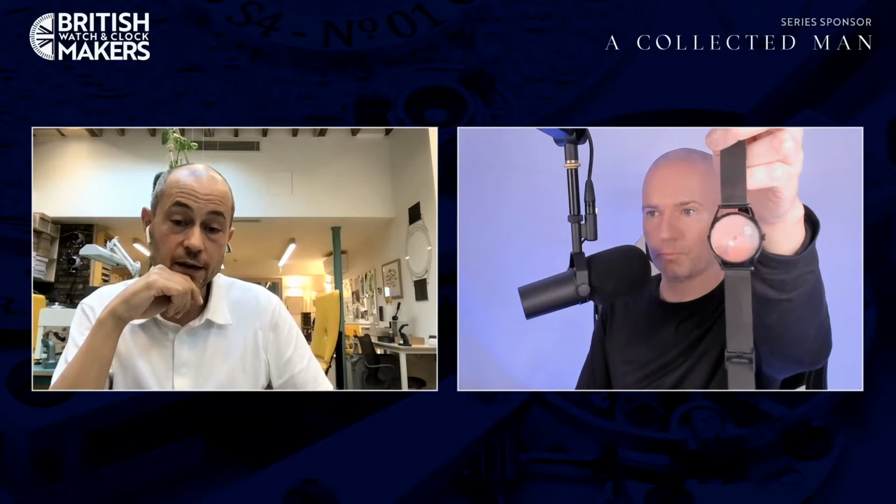This is a really nice thing. So this was designed by Paul, who is the head of printing. Paul is a fine art printmaker as well as working for me. He was really captivated by the Mars rover and the fact that Mars has 2 moons that circle it. So it is the red planet, Mars, and it's got these 2 moons that are glow in the dark. They have a luminous compound in the printing ink, which was something we had never done before. It's quite difficult with pad printing to build up a sufficient amount of the luminous material to get that luminizing effect. On a traditional watch, you can paint it on much more thickly, or silkscreen print it on much more thickly. So for us it was quite experimental to get that effect.